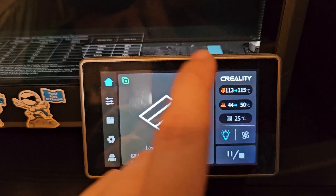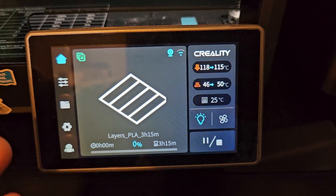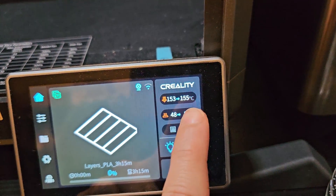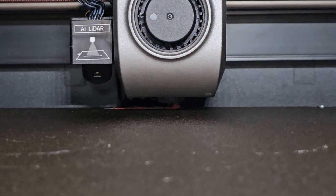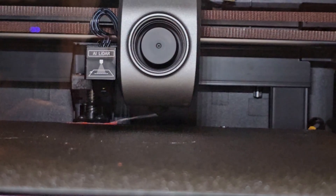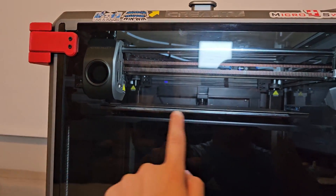The first portion is 115 degrees — before this update it was 135. For the nozzle probing back there it is 155, then it goes to 185 and lets out some filament to clean the nozzle. For this probing phase it's 115, not 135 anymore. That is what it's cleaning off at, and it looks like it's doing pretty well. Oh, I should have saved my G-code macro — darn it, well it's fine.